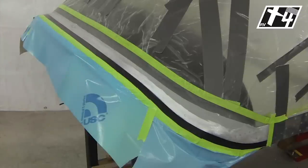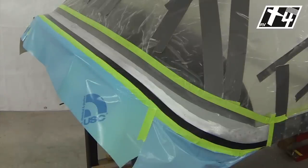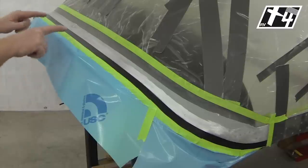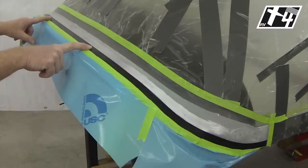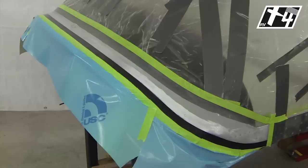Confirm that you've got good protection for the canopy, that there's no plastic that's been pulled off or exposed where you might accidentally get some resin on it. We've added some masking to areas of the forward skin on the canopy frame that we don't purposely want to have any resin or fiberglass on. The treatment right beside the edges of where the layup is going to take place, using references from the construction manual and templates, is two layers of vinyl electrical tape. Use some good quality tape like 3M, not something cheap from the dollar store.